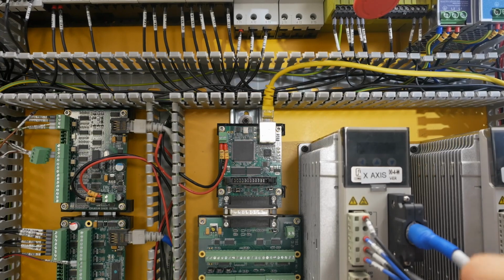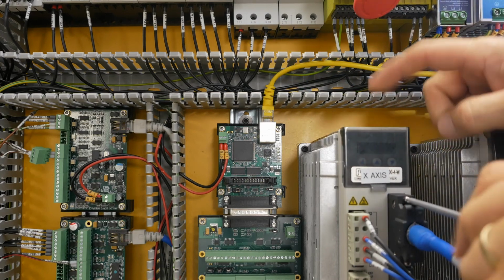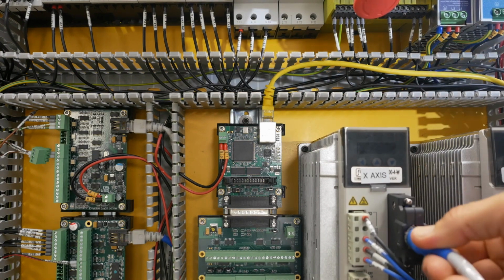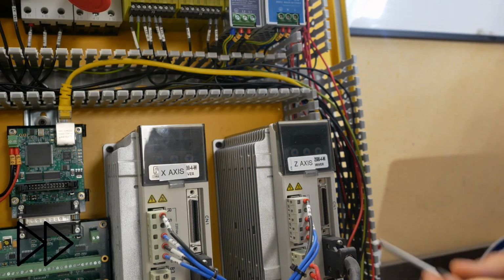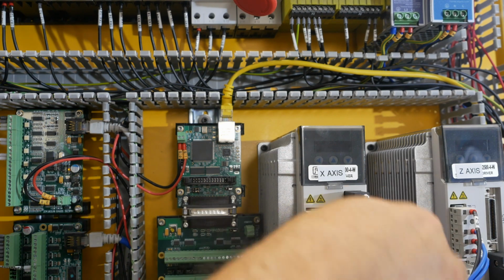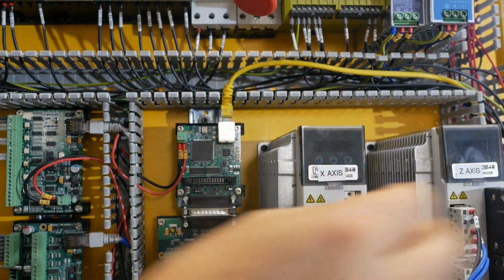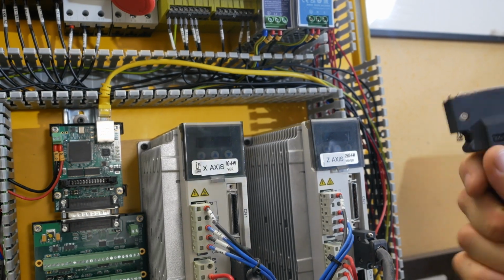Is the problem in the cable or in the connection of the cable into the driver, because this is the driver which I blew up, so it's definitely easily possible that it's some sort of a driver side brain problem. Okay, known good cable. I've got light there. That would imply that it is a cable problem. And no light. So it's a cable problem. Since I made the cable, I can remake the cable. So that's a good thing.